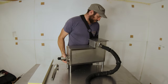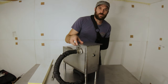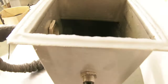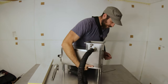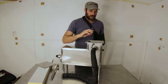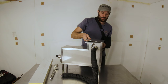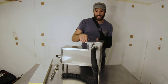If we turn it around to the other end without dropping it off the table, you'll see there's a hole there — that's actually a ball valve. We can take the cap off and inside there is a ball float valve, which keeps the water level at the right height. This cap I've made here is just another stainless plate. I love making gaskets out of silicone — I just run a silicone bead around there, lay the plate on gently, and once that's set you take it off and you've got a really nice gasket.